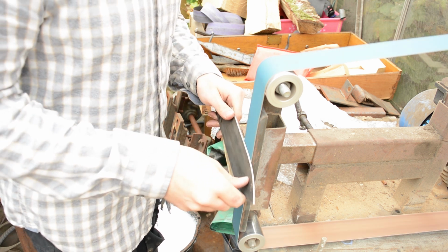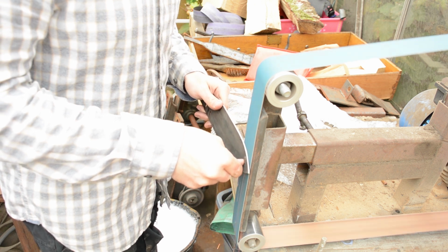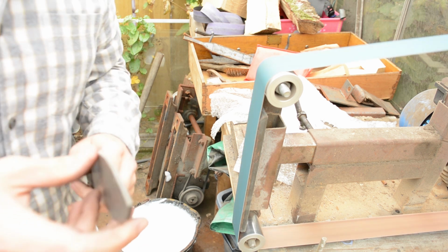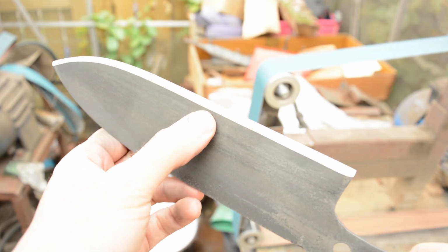Once your 45s are done, you tilt the knife slightly up, like an old style printer. But the further up the steel that you work the bevel, the thinner the knife will become just by itself. You don't need to calculate angles or anything like that.